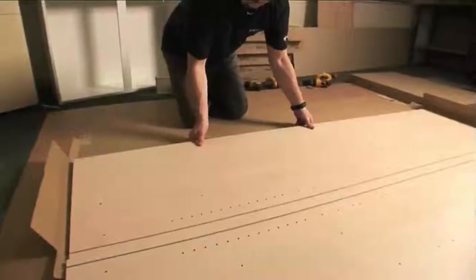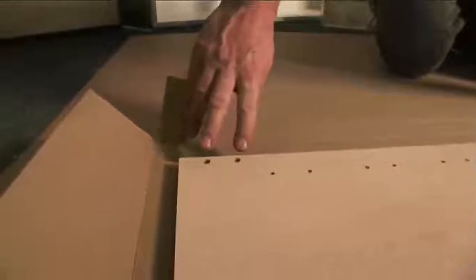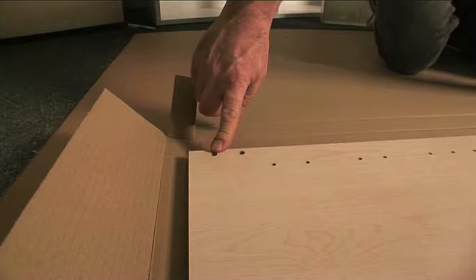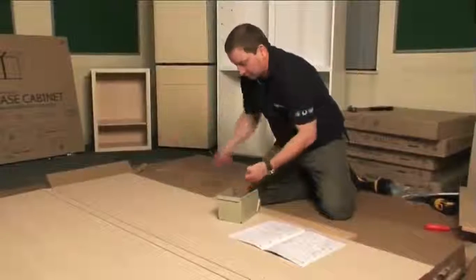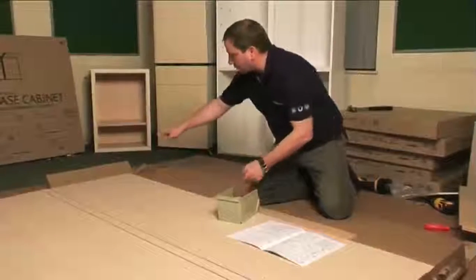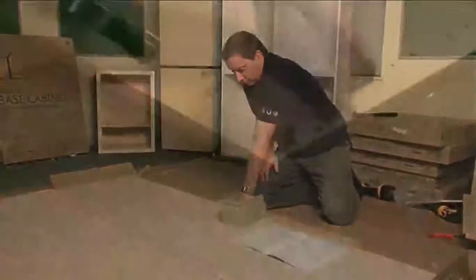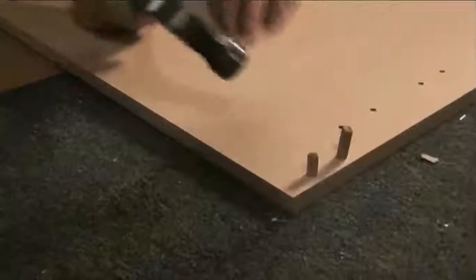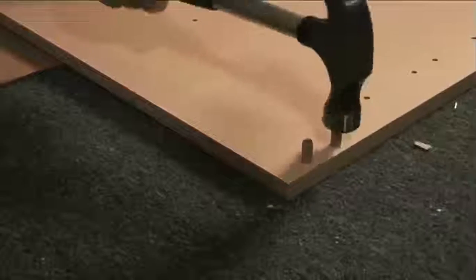Laying the panels out groove to groove. This is the bottom of my double wardrobe, indicated by the fact that it has two 8mm dowels. I'm going to put my wooden dowels in the base — six in total. Don't tap them too hard in case you punch through, but tap until the sound changes.